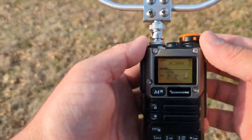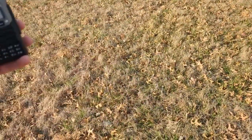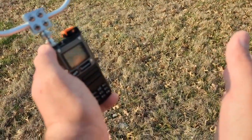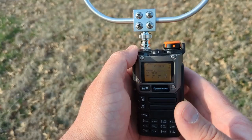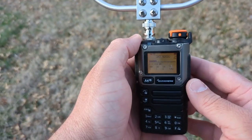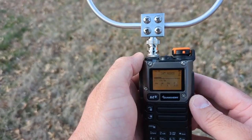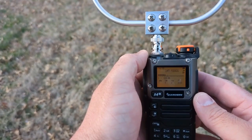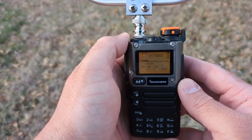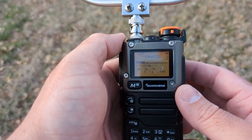The loops are really handy, easier to carry around, and they also get a much more precise bearing. Your Yagi has a 20 or 30 degree cone where it's pretty strong, and it's sometimes hard to find the exact middle. On your loop antenna, the signal dip is a much narrower arc — it's much more precise for a bearing.